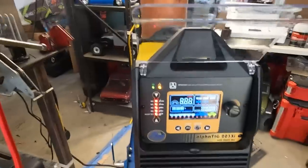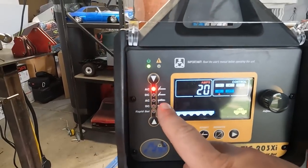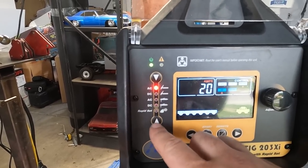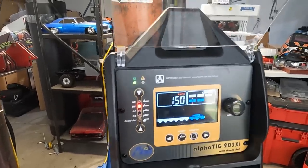There's a circuit breaker style flip switch on the back side. A little fire-up screen. It has AC TIG, DC TIG, AC stick, and DC stick modes. I'm going to do DC — almost everything I do is DC. I like that this machine has AC capability; someday I'll play with that, but for right now I'm going to kind of stick to what I know.